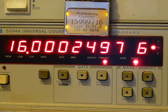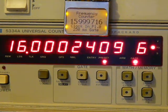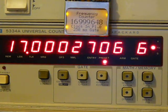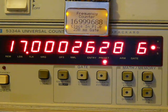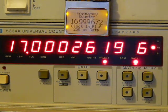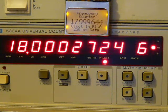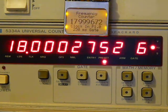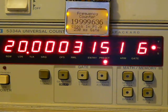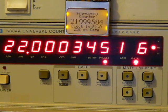There is 16 MHz, which is the upper limit for the MSP430. And if we try 17 MHz — well, that works. 17 MHz works. And 18 works. Let's try 20. And it goes all the way up to 20. That's about what I expected. I've been able to clock the CPU at pretty close to 20. And even 22 works.